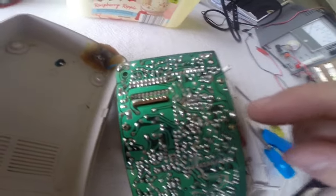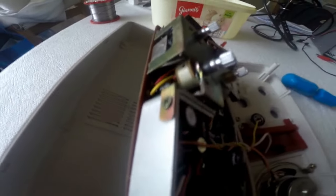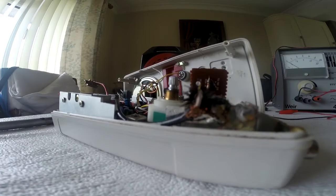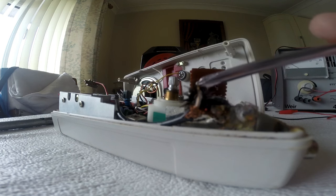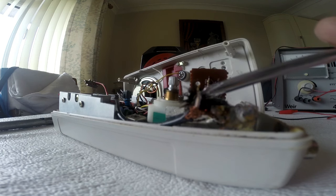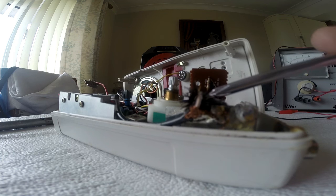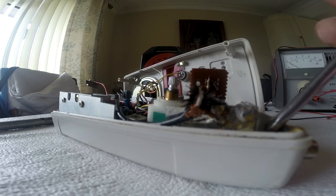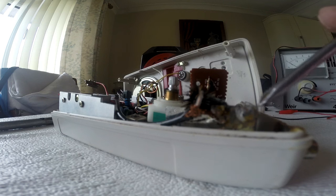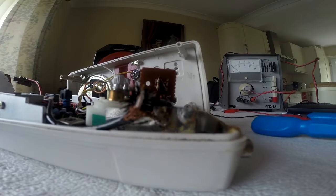So when you've undone the top nuts, there are 1, 2, 3 screws underneath that you have to get undone as well. There's also another screw in the side that goes around this arm that you've got to take out to get that cover off. So I can't make out, I've got the screen soldered to the case, which is fair enough, but I've got this little bit sticking up and I'm not sure whether that's the middle core, whether that's actually connected to anything. And then I've got this lump of insulation tape running down here that seems to be connected to the blue antenna wire. So I'm going to take all that out and desolder it and get it out, and then we can see what's going on, but it looks an absolute mess.